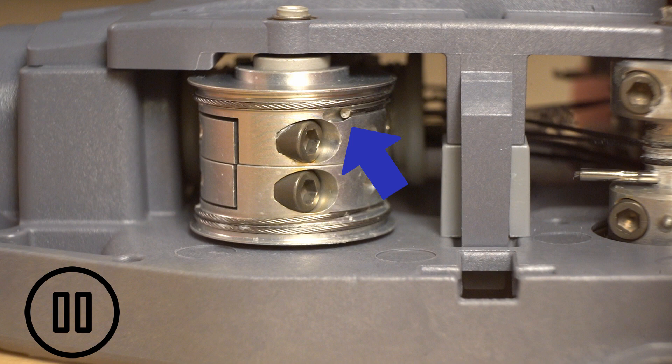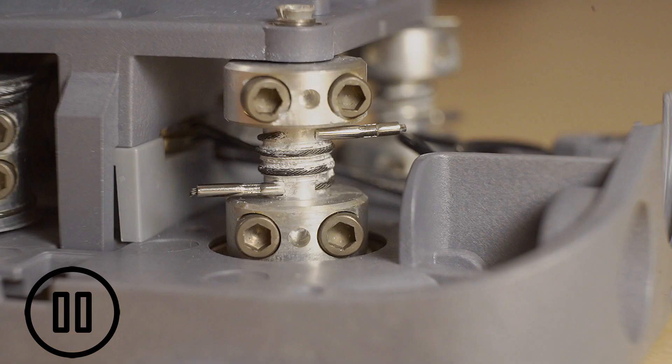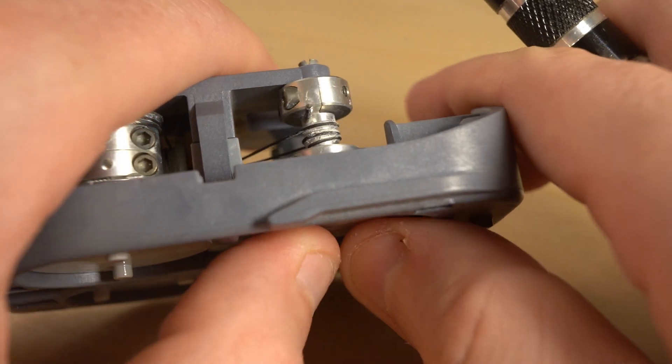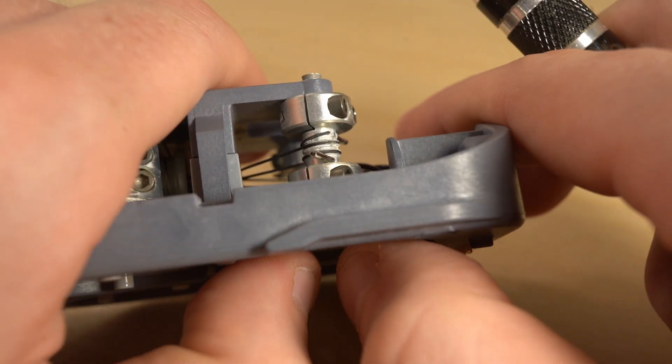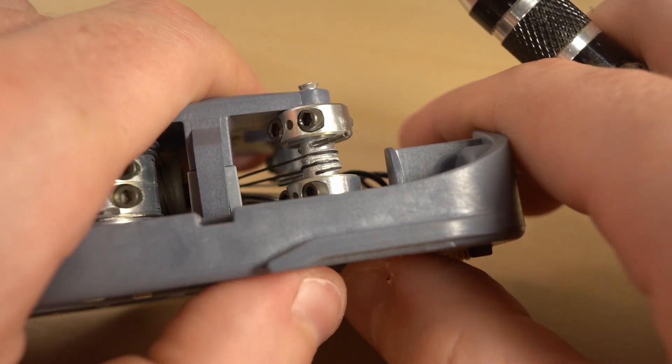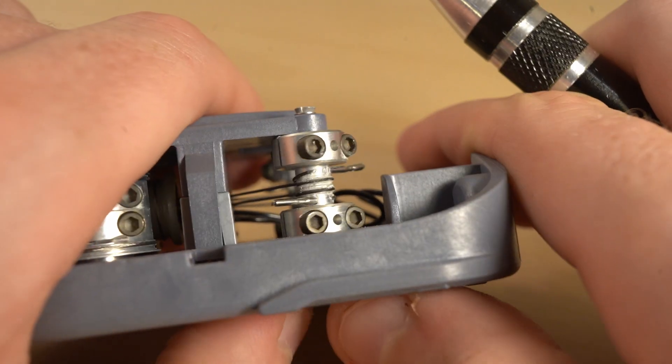This other type of pulley is used for the other three axes - essentially the same but with a much smaller diameter, and ferrules sticking out of the side. There's also significant corrosion built up on this pulley, presumably due to galvanic corrosion between the aluminum pulley and the steel cable. Any anodization or coating must have worn away, allowing current to flow and corrosion to appear, and this is certainly amplified by being cleaned multiple times in an autoclave.